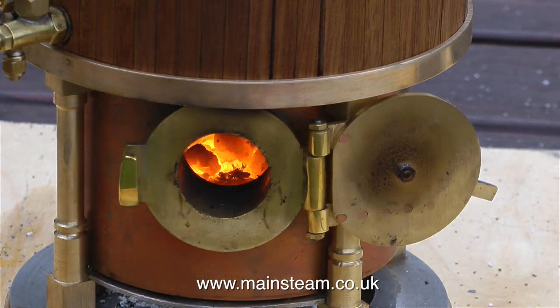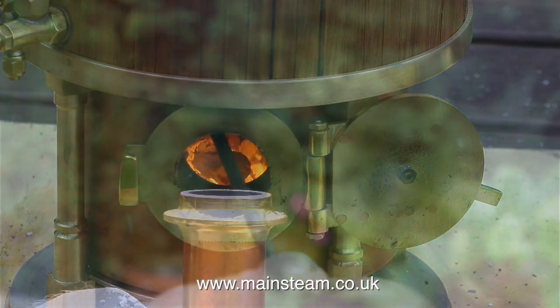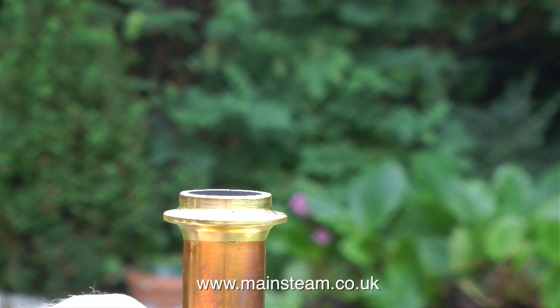When I look at the fire, I see that it's really well lit. If I look at the chimney, there's no smoke — there's a lot of heat coming out of the chimney but no smoke. To show what happens when I turn the blower up: you get a lot of ash coming up the chimney as well. Some of this ash is lit, it lands on your head and it's very painful — especially if your hair's not as thick as it once was.